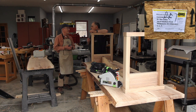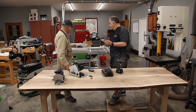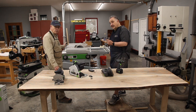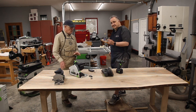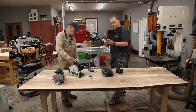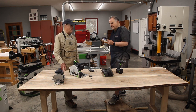We've used a number of tools in this project. We've used the Felder KF500, which is both a table saw and a shaper, as well as that Hammer planer and joiner to bring a lot of this wood to size — more down in the trestles than anything. For these big slabs, we took them to a mill and had them run through a wide drum planer.